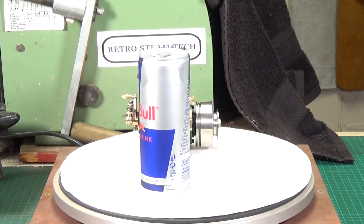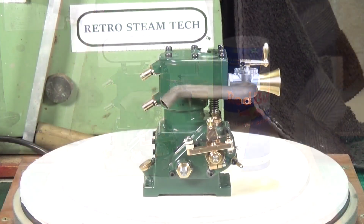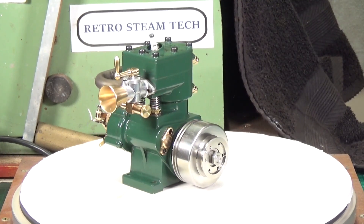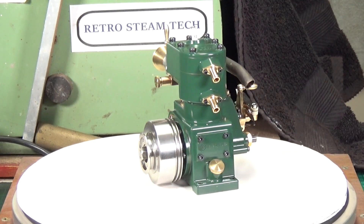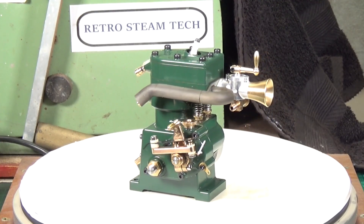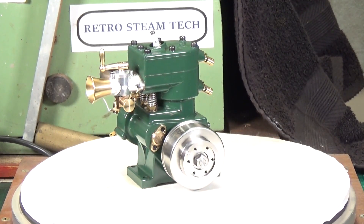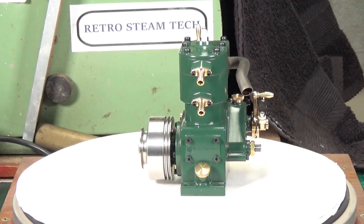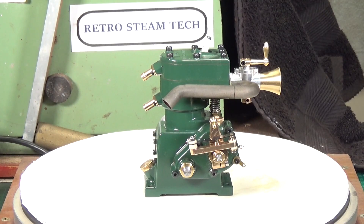There are several things I've got to do before I can run this engine. It needs a fuel tank, which I haven't got, so I'll have to make one. It also needs a water tank for the coolant. I don't intend to run it for long periods of time, so I'm not going to bother with a water pump — the thermosyphon effect should cool it long enough for the short periods I'll run it. It also needs to be mounted on a baseboard, and it would be really nice to get it to run something. There is a water pump accessory made by the same people, but it's about $130, so I'm probably going to come up with something else.